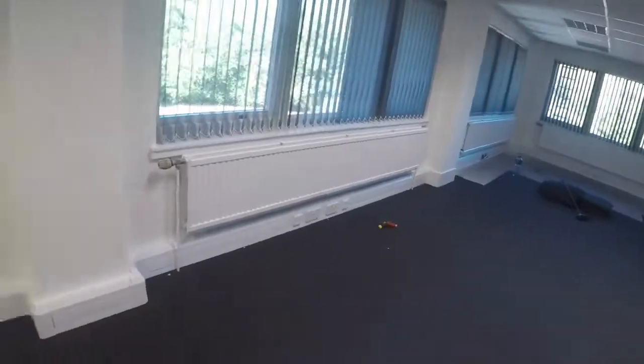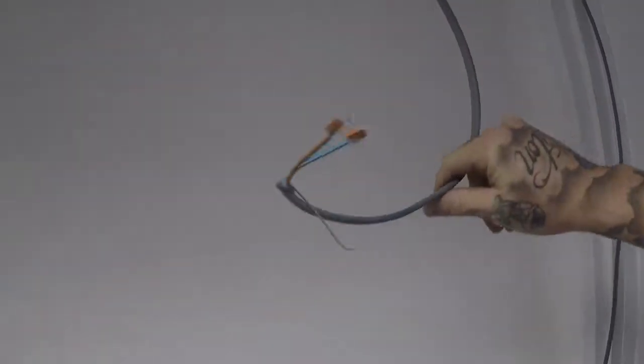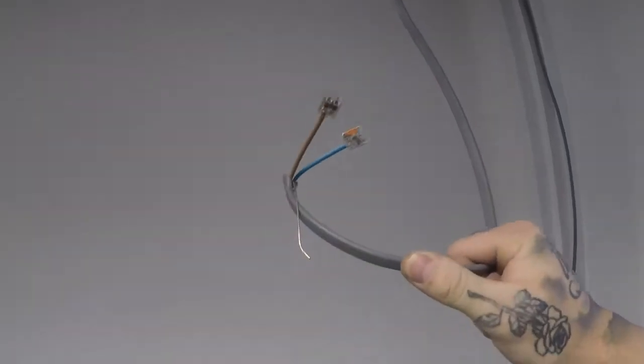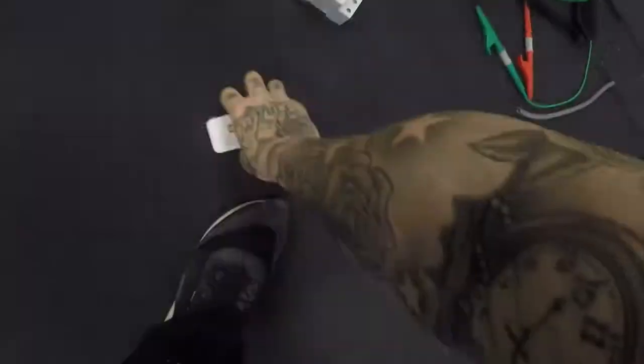Right, that's all the socket faces put back on. All rewired. There's a radial around here, around here. Got a bit of cleaning up to do. And that's the leg of the ring main that had no power. I've blocked it anyway, and what I'll do is stick just a little D-box in there, just clip it up there, make a note that it's up there.